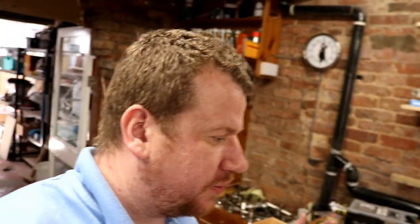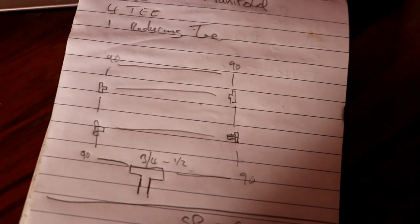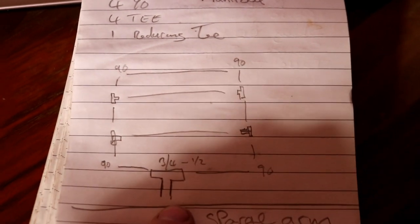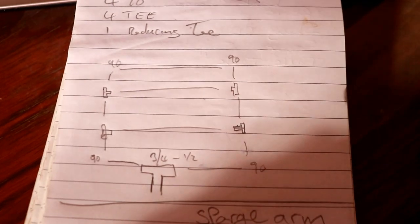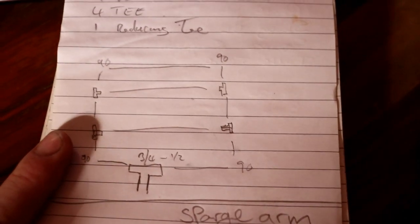I've got a pile of bits out on the table at the minute because I'm trying to figure out how we put together the manifold for the mash tun. I've just been sat here in front of the computer doing a little bit of a sketch. We're just going to have a couple of cross braces running across there — four T's, a reducing T to give us a three-quarter inch outlet, and then we'll use half inch copper pipe for the rest of it. Four 90s, one in each corner, which I have. I just don't have the T's, so it's going to be a case of tool station to the rescue. It's gone 12 o'clock already and I've literally got nothing done.